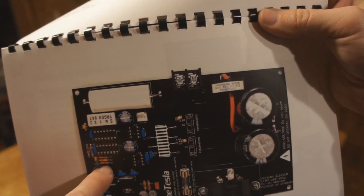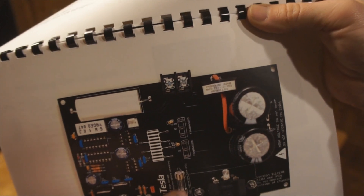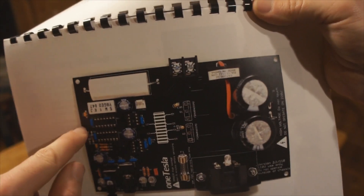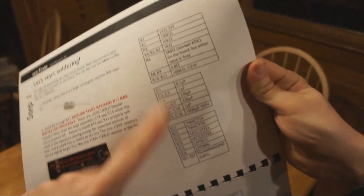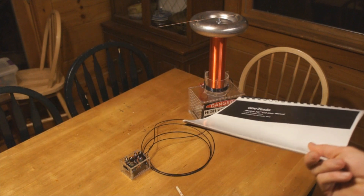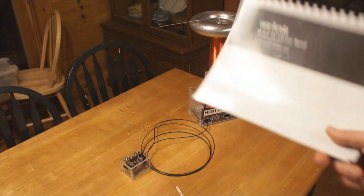I was racing ahead building this board, and because of that little mix-up on my part I blew out about 20 fuses and four or five sets of IGBTs. I was really pulling my hair out trying to figure out what the issue was. Then I went back and started testing the component values and comparing them against the specs, and that revealed my mistake. Once I got that fixed, it just ran — worked like a charm.